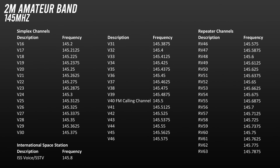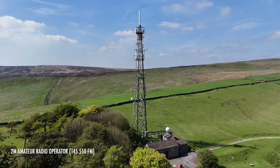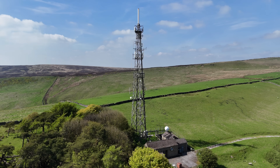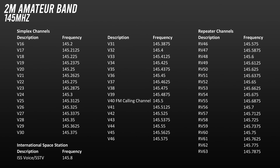If you listen between 144 and 146 MHz, you're likely to come across amateur radio operators talking to each other radio-to-radio, or with the help of a repeater. This is the 2m band, and these operators have a licence to speak to each other on these frequencies. Certain repeaters are linked to countries like the United States, so you'll often hear American operators talking in the UK. There's also a frequency for the International Space Station within this band too, and you can sometimes hear astronauts talking to ground stations such as schools and colleges.